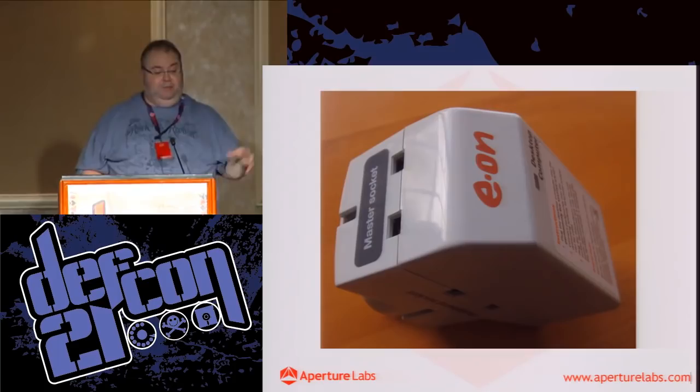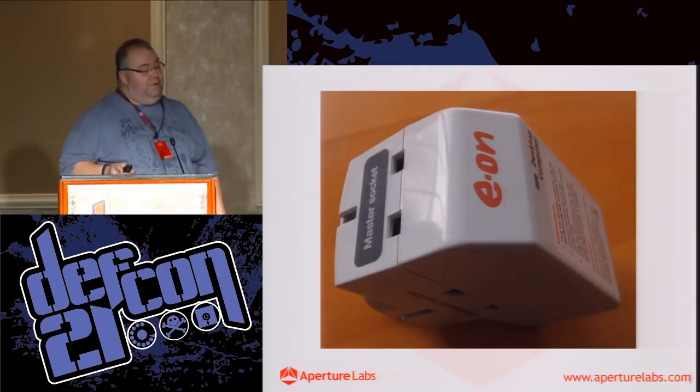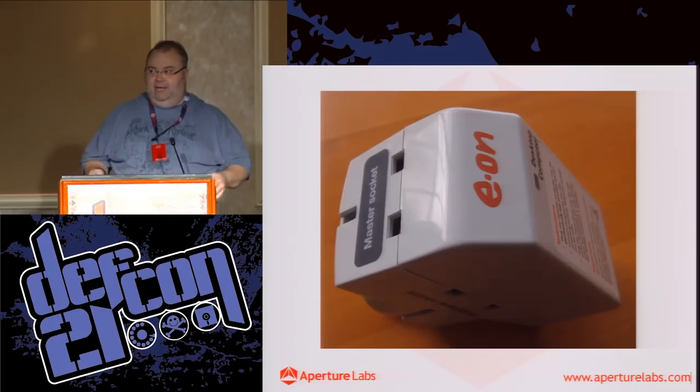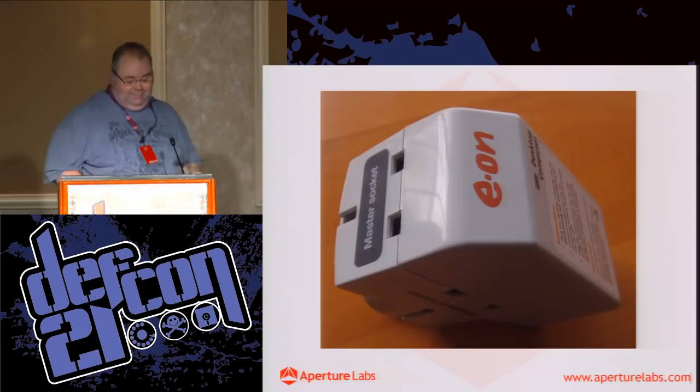Basically, they'd plug the power tool into the master, the extraction system into the slave, and as soon as they turn it on, extraction starts and they can go. The only problem is there's a 5-second delay between the master turning on and the slave turning on, and they just can't handle that. The alternative, if you went to buy one, they charge 150 quid, so about $250, for something like this. This costs 8 quid, for something that's doing pretty much exactly the same thing.